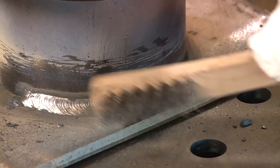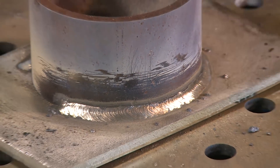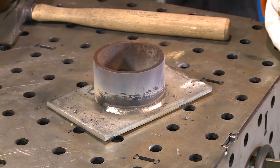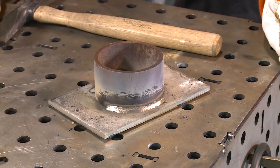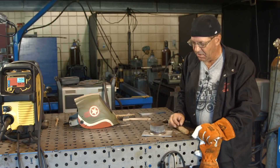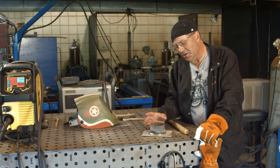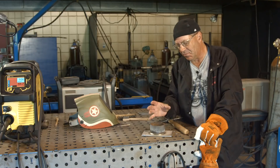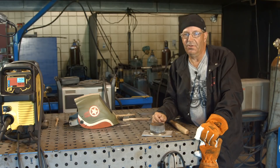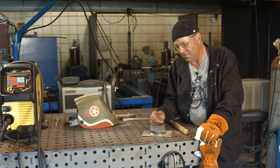We have a couple of spatter specs that came off. I've run a lot of different stainless rods — some run really well, some are a little rough. We talk about the composition of the flux. Certain brands will run what we call out of position. This was a horizontal fillet weld, but if we had to do this vertical, the nature of stainless steel is sluggish and fluid. Some don't run very well uphill — we would not run it downhill, that's a large no-no. Overhead I wouldn't be too scared of; again, short arc length.